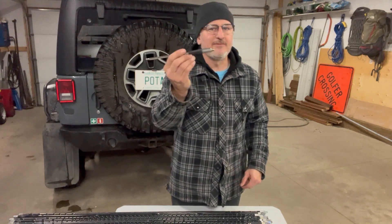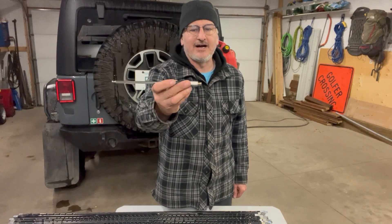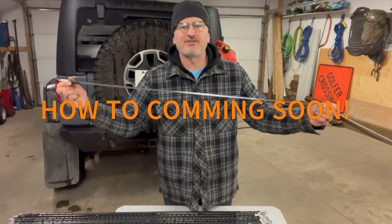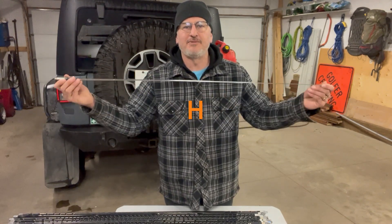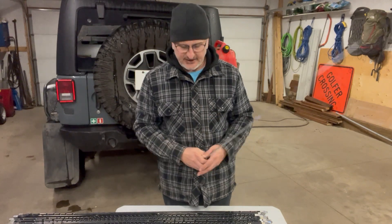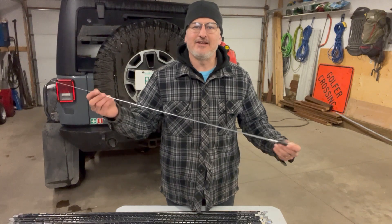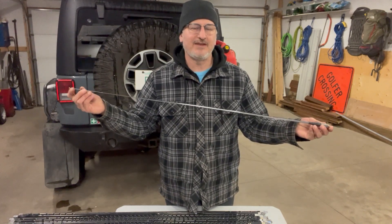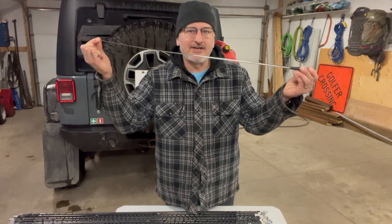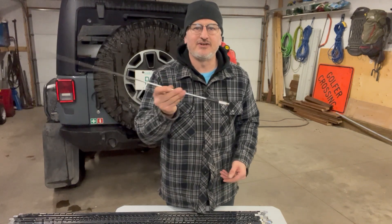I built this one. I simply used a little part of an antenna that would normally hold a whip, soldered the two together, put some heat shrink on it, and bought this telescopic whip off Amazon — it cost a few bucks. Very flimsy — I don't think I would be driving down the road with it, it'll definitely break. But for stationary use, it works awesome. Right there is exactly what I need.